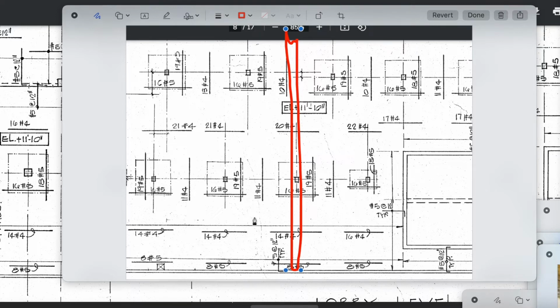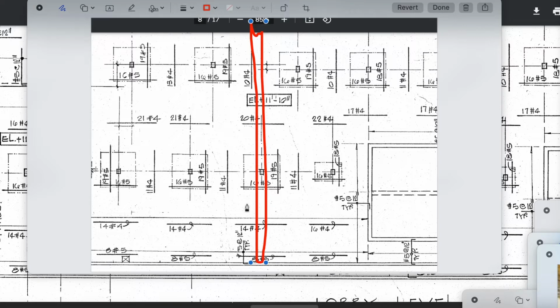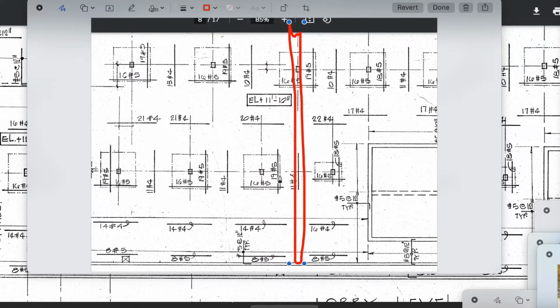Steel two directional. Now I want you to start seeing, wow, look at all the different behaviors here. As this steel goes this way, this is more like a mini beam, if you will. It's going to act in a beam capacity, stressing this more so as it tries to take the load there. And then out here, across this section here, remember it's two directional, I'm going to back that up. So this is 5/8 steel in this configuration. See the shape of it?